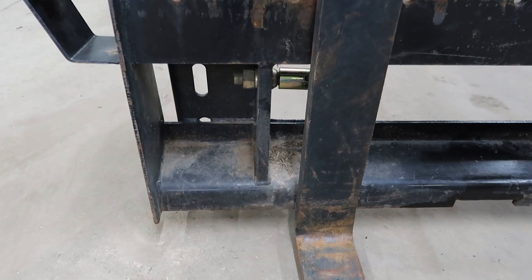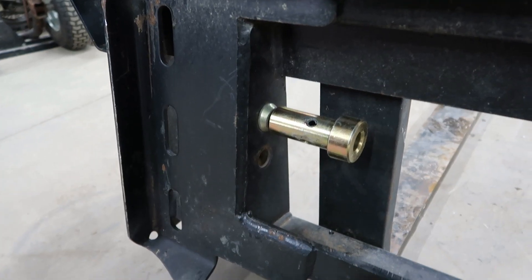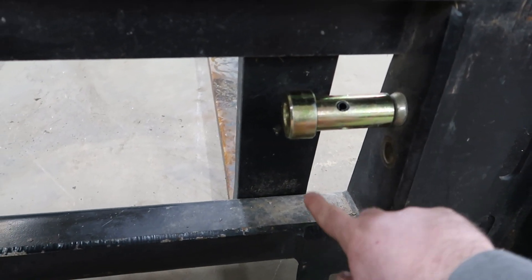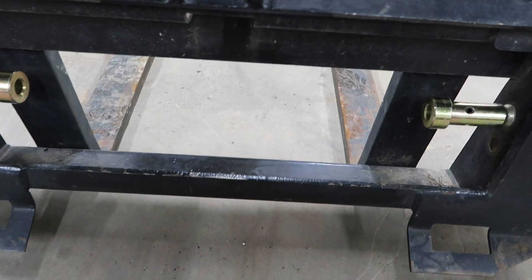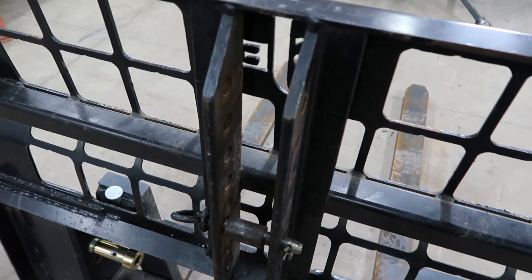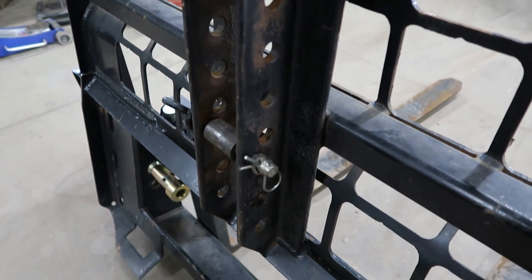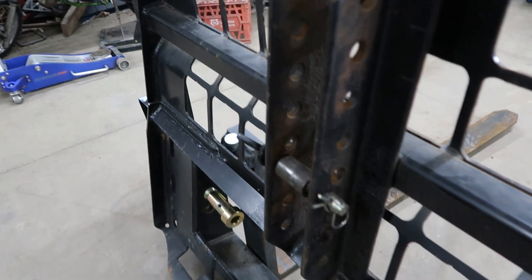They were factory built. What I fabricated to make them work on a three-point: I added in these three-quarter inch plates and I cut out part of the original skid steer quick attach plate there so I could get the clearance of the 27 inches for the bottom draw bars for category one. For the top link mount, I made these half-inch angle iron braces with multiple holes for different pin locations, and added this two-inch by quarter-inch square tubing across here to give some more rigidity.